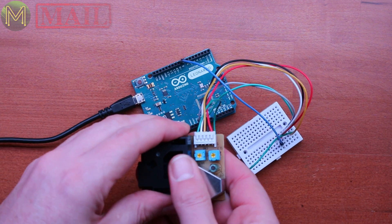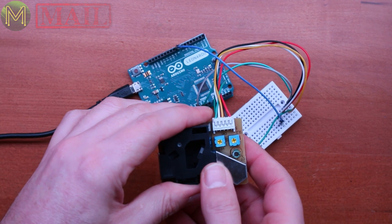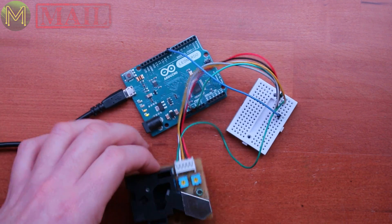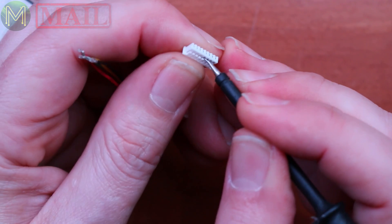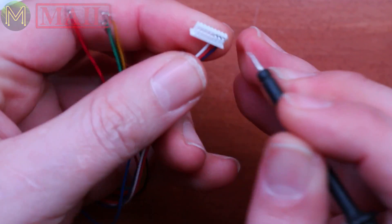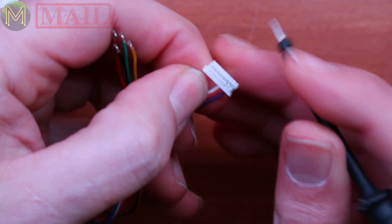These little modules actually have little heaters on them — you can feel it. The heater is just a plain low-resistance resistor, and it's getting quite warm. Let's try out the laser sensor this time. The connector on this particular sensor has very tiny connectors, so I'm going to take these off, remove them, and solder on something I can actually connect to.